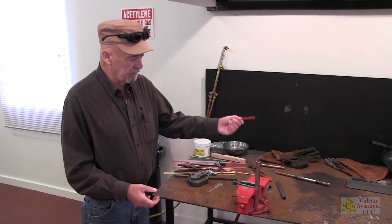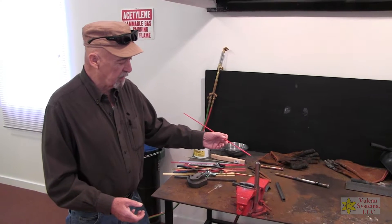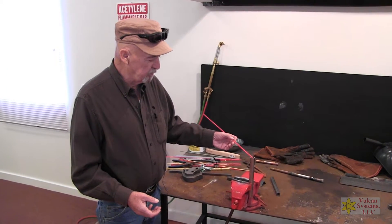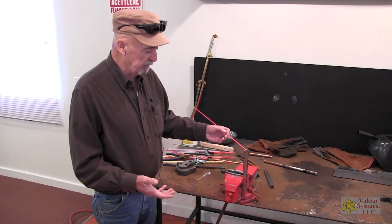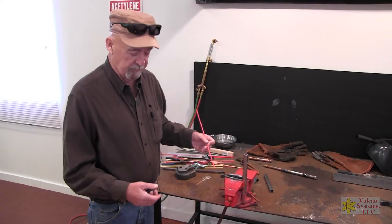What I'm going to do is take this Nickel Bronze Brazing Alloy and fill the end of this tubing right here with this alloy — not running it, not dripping it. We sort of slang term it the out-of-position brazing rod.